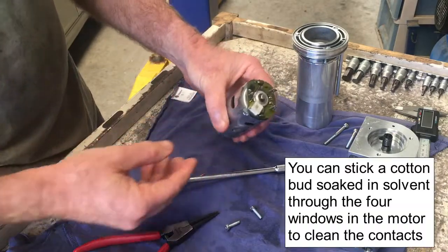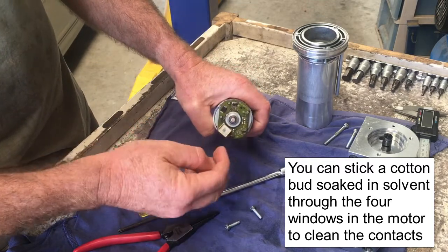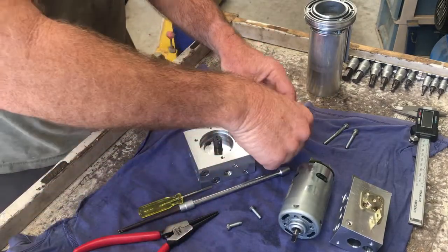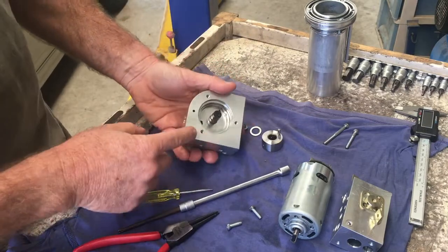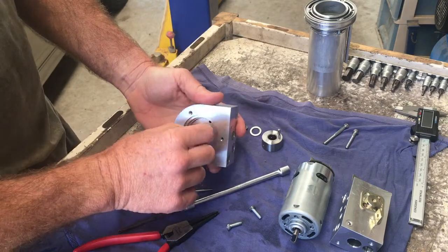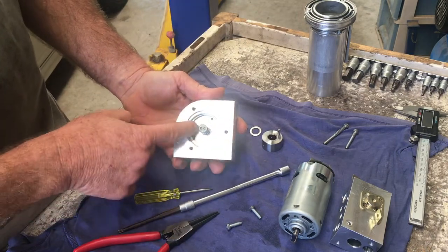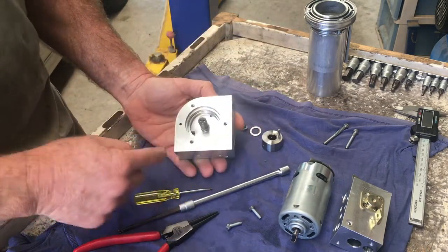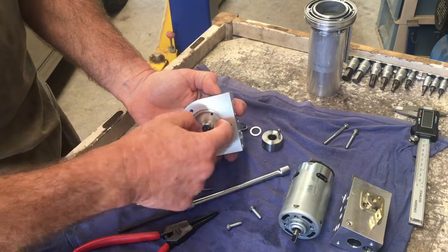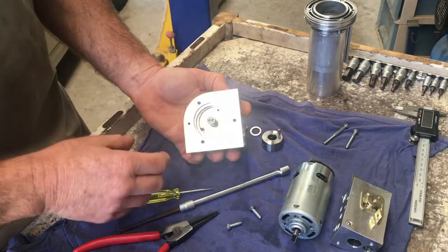And there's our motor. The motor itself — if you wanted to replace the motor, the circuit board needs to come off. So you'd have to just remove the solder from those two pins there, take that off, and put that onto your new motor. The way the pump works — and it's quite an ingenious little thing — you'll see the shaft here and it's got these two slots in it. One slot is the intake and one slot is the output. So what's happening is that on the intake side, that is actually going to come from that standpipe, which is actually going to come in by that little hole there. So the one on this side here is actually the intake, and on the outside there the fluid is actually going to get pushed into and out of the pump mechanism out the other side.